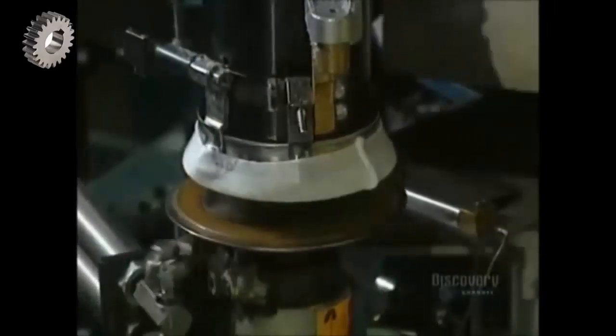Everything is ready for installation of the gusset. The pantyhose is placed in a tub and taken to this department. The stocking is again suctioned and placed on a gusset machine by the operator. This method assures that the gusset will be installed well-centered without a pleat.